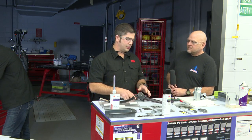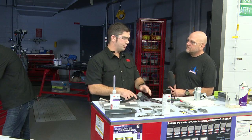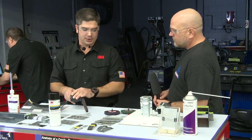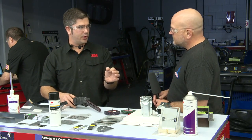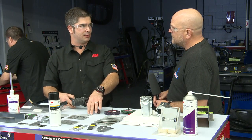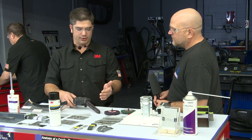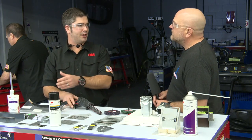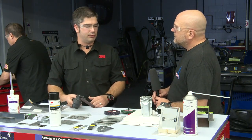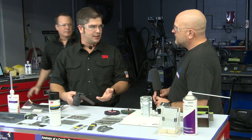One of the things you can do is use a test piece. If I had an 80 grit belt on here and I'm removing a weld, actually count the number of seconds to when you get to where you need it to be, so we're not going too deep into the lower substrate. Then just count that rhythm as you're going down the panel. You don't need to push really hard. I see a lot of guys really reef on it. You don't need to do that, right?